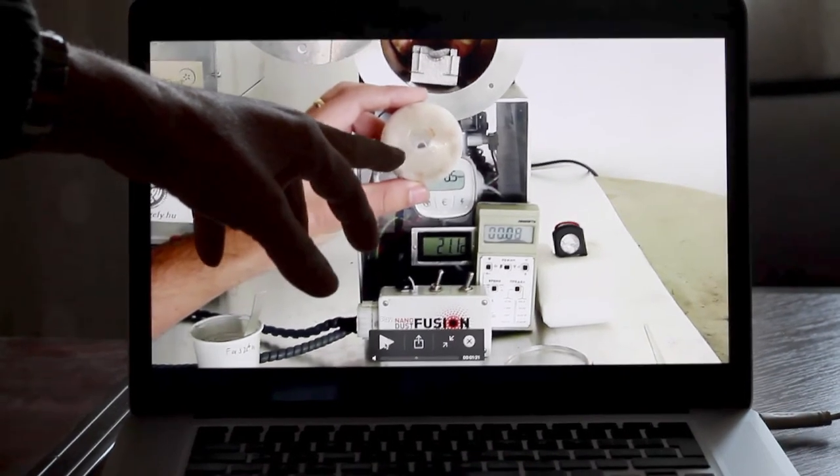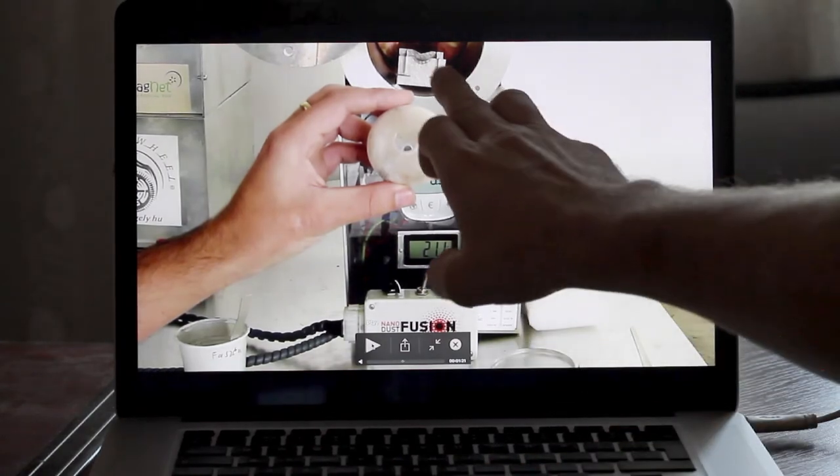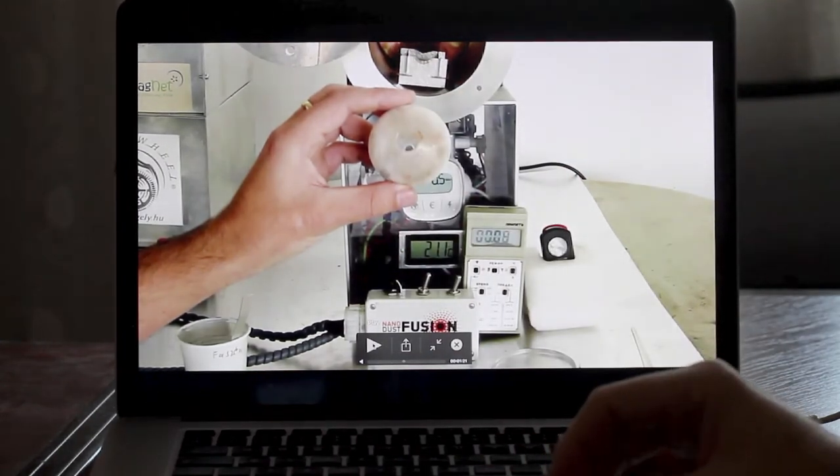Anyway, from this point, as I see, you can see the smaller hole on it, and it's over there. It's a little bit dark. For a fraction of a second, you can see. Yeah, so we have the larger hole here and the smaller hole. It appears smaller because of perspective, I guess. Yeah. Smaller than it actually is, but it is small. Okay, and so this is mica, this support framework you've got here. Mica. It takes some patience until you find out how to make these little stands from mica. But you can do it from quartz, but not from any other material, because heat resistant glass will melt. Definitely, we have tried, it's useless.